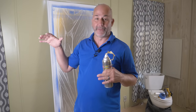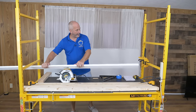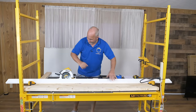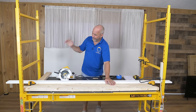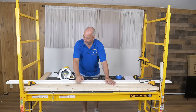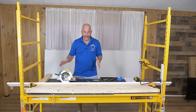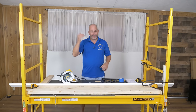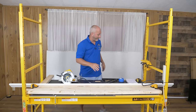We're going to put the doors away in storage because the next step in this room is to put the subflooring down, then get this place primed. Welcome to the cutting station. I've got to set up a cutting station in this environment because we're going to be cutting particle board, and you don't want to be in the same room as particle board when cutting it. We'll do the cutting out here, make the boxes, cut our French cleat, and then go do the installation in the other room where it's nice and clean.